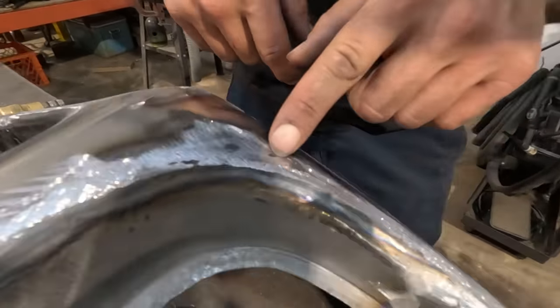Look at how nice of a job that does. I'm not just going flat, I'm also going on an angle this way. And so the disc is doing that. You're not directly on that so that it's digging in. The disc is spinning like this and it's going like that. Works beautifully for blending, just beautifully. Getting out a couple of these little shrink marks. Okay.